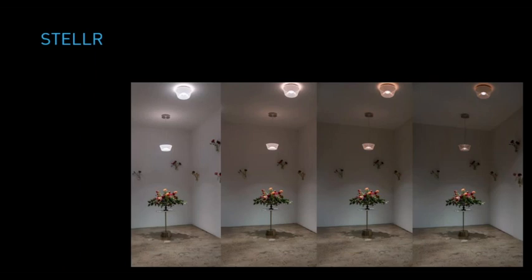The surface luminance on this fixture, we just nailed it. We got it perfectly, and we've received rave reviews on what it looks like when the fixture's turned all the way up. And if you're working left to right on this image, it's taking our warm dim technology from all the way up at 3200 Kelvin to all the way down at 1800 Kelvin. So you can see it staged out there.